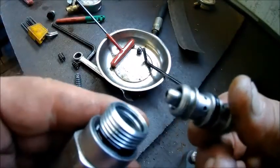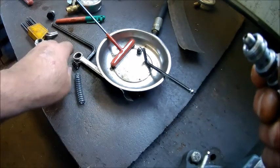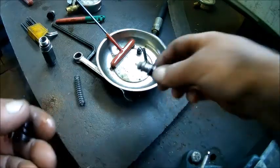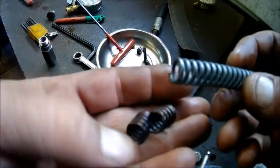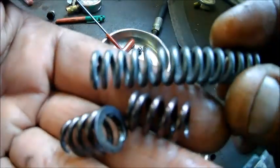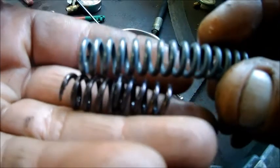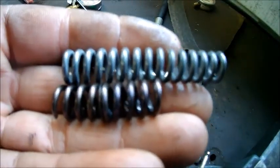Okay, Gordy was right. The valve unscrewing is all our problem, but we did find a broken spring in there too, so that could have been part of our problem. We went to Smith's where we got a spring that looks pretty close, close enough for testing purposes for today. Maybe we'll get the right one from Hydroforce. Probably not. We'll see what happens.